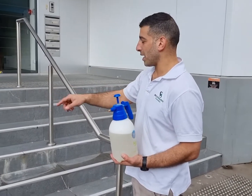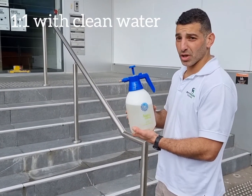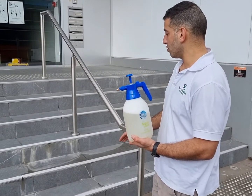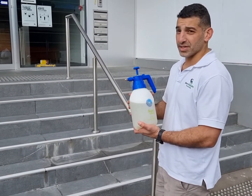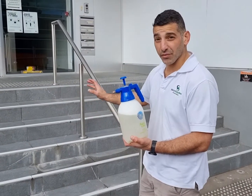It's in all different parts. We've done a mix here at about a one-to-one ratio — one part Slurry Safe AR and one part water. We're not going to pre-wet; we're just going to go straight on, because the product itself won't affect the porcelain tiles. It'll only attack the efflorescence.